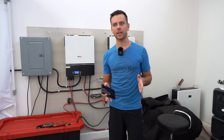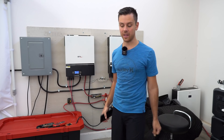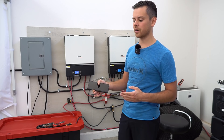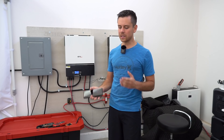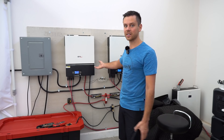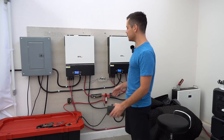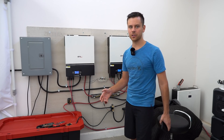Personally I wish we could have little nuclear reactors with a lithium titanate or lithium iron phosphate system to charge everything — those things run 24 hours a day. Solar you can only extract from 5.5 hours a day, up to seven in a really good environment, but as low as three sun hours in cloudy climates. Solar panels are cheap though — you could over-panel this system to 16,000 watts, have a 16-kilowatt-hour battery, and limit the current on the output of the inverters to charge at max output for whatever your battery can handle. You can make this system work in so many different ways.